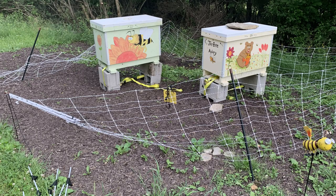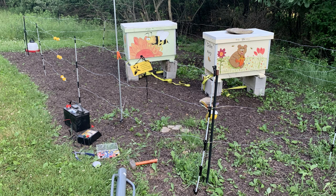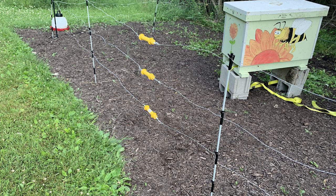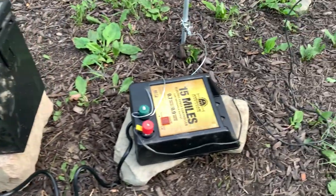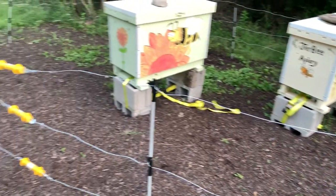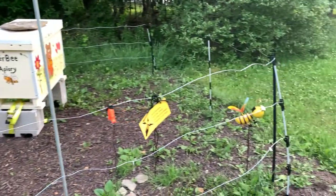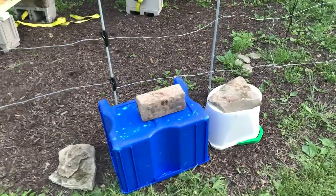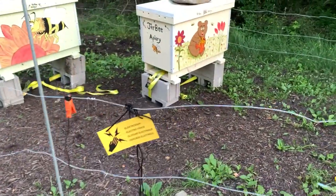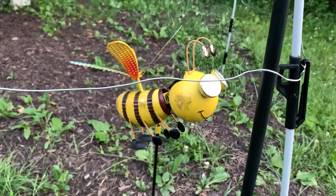I went to Tractor Supply to get some new fencing to prevent this from happening again. I got new fiberglass fence posts, ran some wire, and hooked up a new energizer that is DC powered and connects into a deep cycle battery with quick disconnects so I can get in and out easily. I ran them all hot — it's putting out about 6,000 volts across all three wires, with a big ground rod about three feet in the ground. I also repurposed a bucket and a recycling bin for covering up the battery and the energizer.